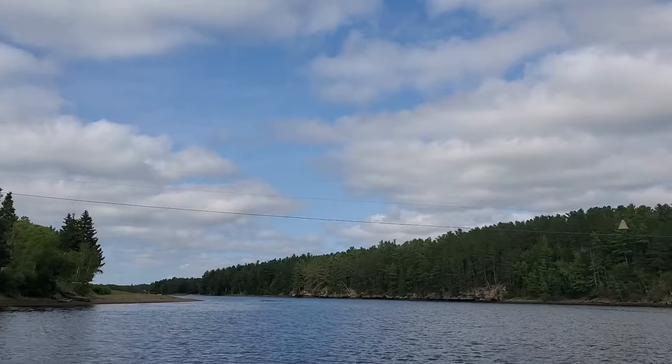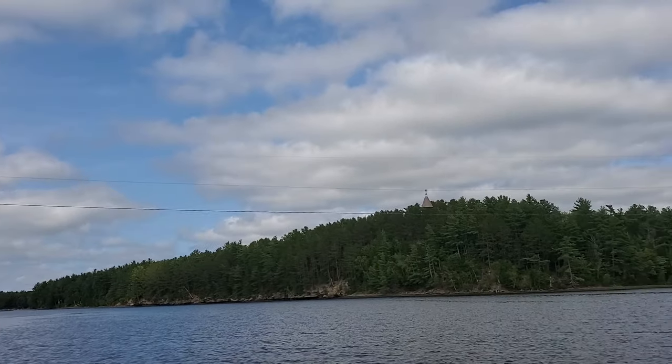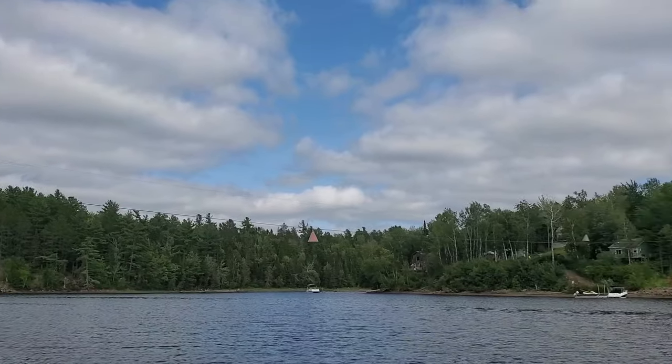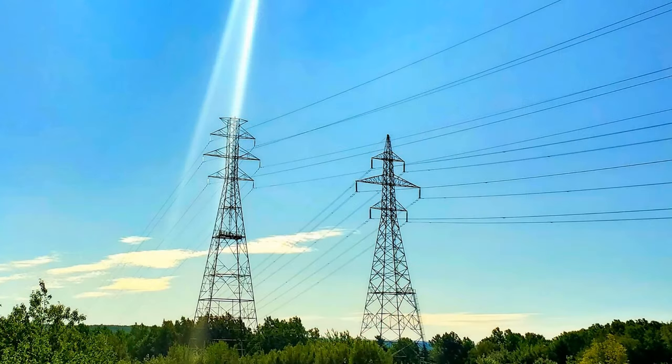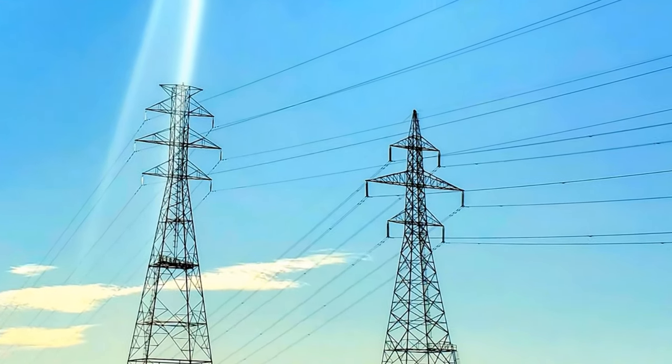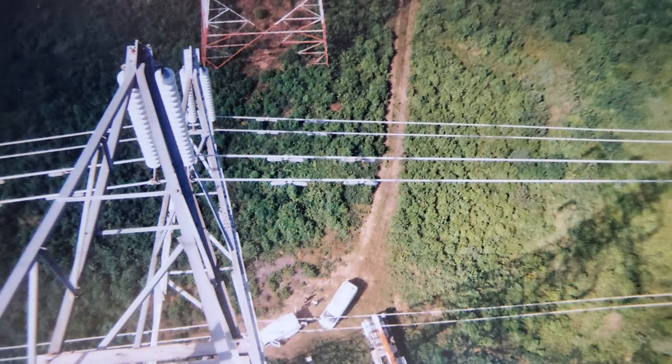Sometimes you'll see a river crossing overhead where they have just a typical structure, usually built a little bit different. They might use a heavier gauge wire, maybe build a three-pole structure instead of a single-pole structure, with guys on both ends depending on the distance the wire's crossing. Probably the largest crossing in my area for overhead would be 1,000 meters — one kilometer — a 138,000 volt high line on some very tall towers. I was actually on top of one of those towers probably about 16 years ago.